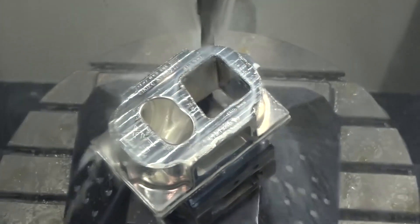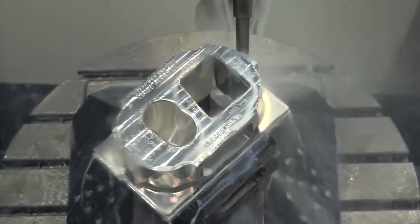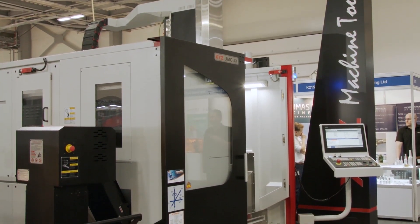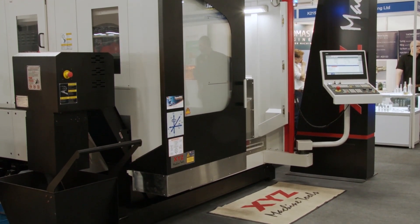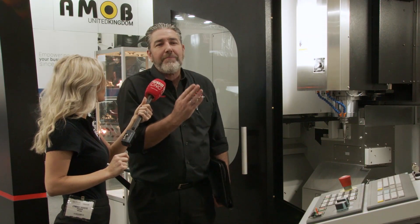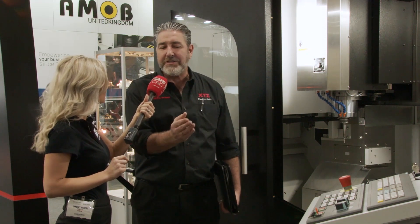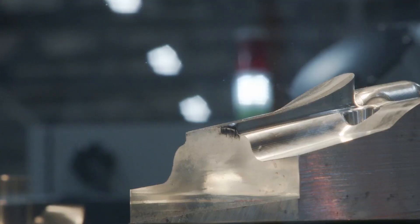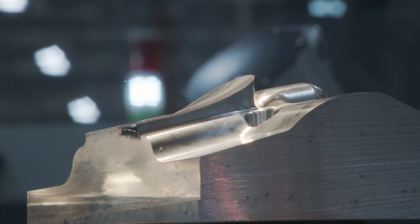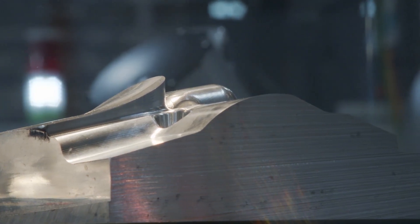It's an incredibly accurate machine. As mentioned, linear scales are standard — you've got linear repeatability of 2.5 microns in all axes, and plus or minus 5 arc seconds on the rotary axes. It's aimed at people doing multiple operations on three-axis machines who want to eliminate second and third operations. With 15,000 rpm, it's also ideal for mold makers and anyone requiring fantastic surface finish.